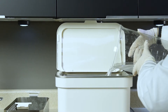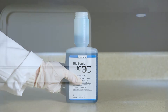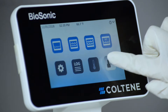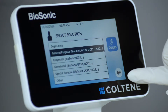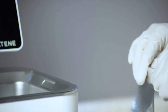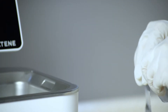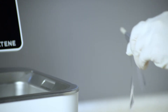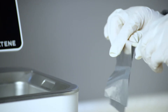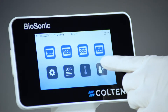First, prepare a fresh tank of cleaning solution according to manufacturer's directions. Run the unit for five minutes to degas the solution. Then, using three rods, suspend three pieces of foil in the solution, making sure the edge of the foil does not come in contact with the bottom or sides of the tank. Run the unit for a five-minute cycle.